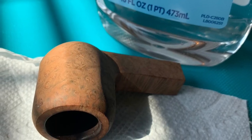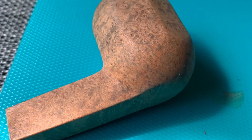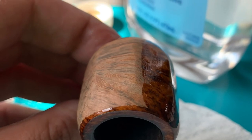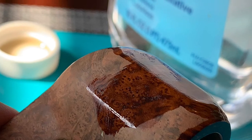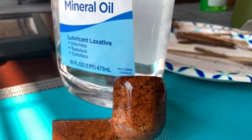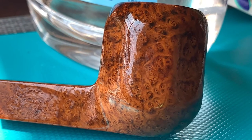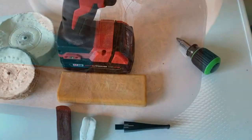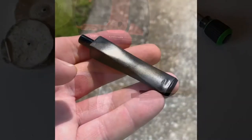During that time my bowl had dried and as you can see it looks pretty dull. When you get it out of the Murphy's Oil Soap you've removed some of the finish — it looks dull. So I add mineral oil. It's really inexpensive and the cool thing is it's almost the magic moment: when you put the mineral oil on it you get a good idea of what this thing is gonna look like when it's finished. I could see all the bird's eye in it — I was pretty excited. So I let that soak in and started turning my attention to buffing out the stem.